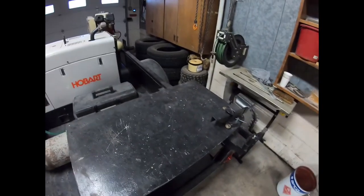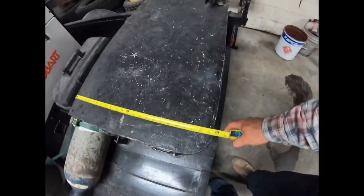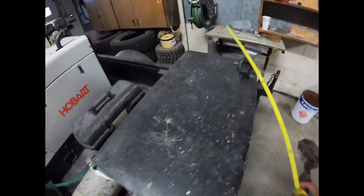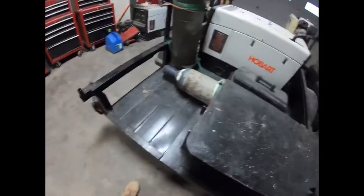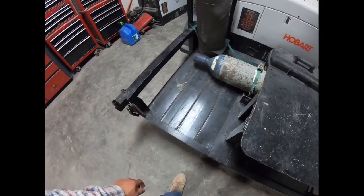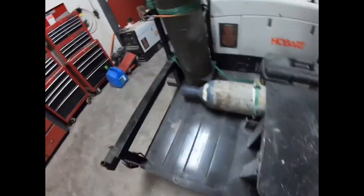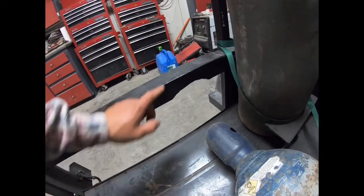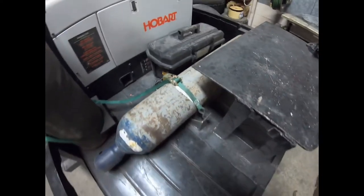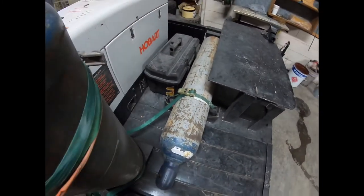The table on the back is made out of quarter-inch diamond plate for the top. The legs are three-inch angle iron — about two foot by about three and a half. I left space on the left — didn't want it to go all the way across — so that in case you've got to carry something bigger than usual you can throw it in this area and use the wooden tailgate. I radiused this angle iron here because I wasn't sure when building on the fly whether we'd be able to lift the oxygen cylinder up and out of there.